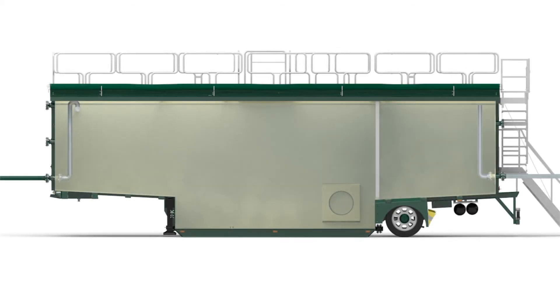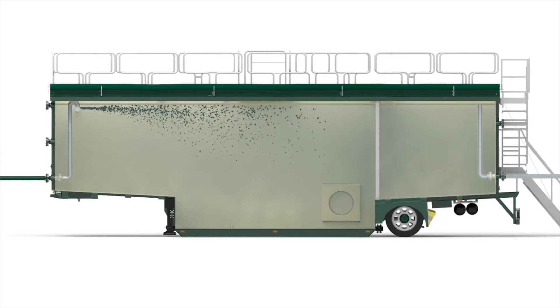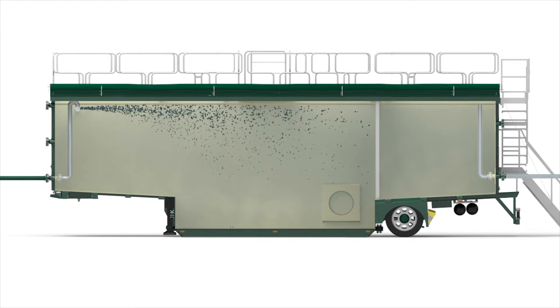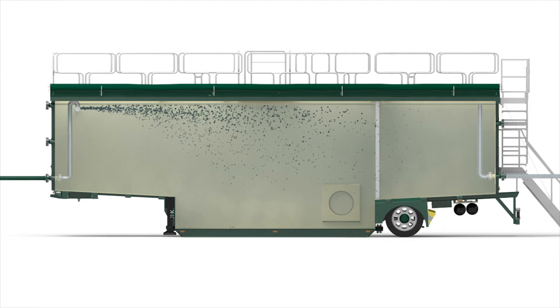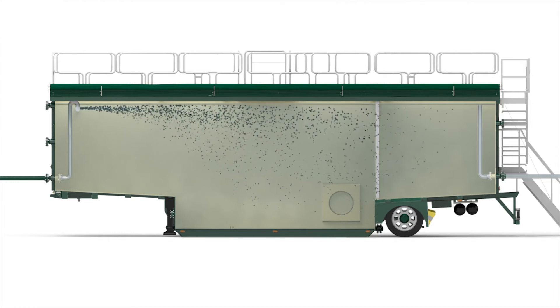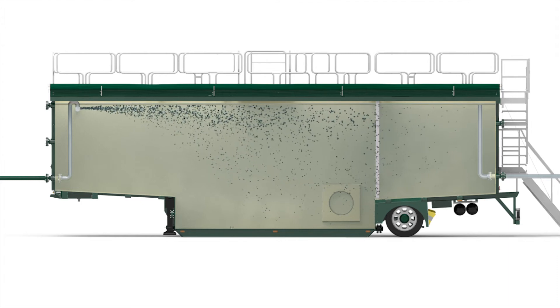The third example is pre-filtration of the waste stream from a cleaning job before it is sent to a wastewater treatment plant. Now the tank is equipped with a permeable weir functioning as basic filtration for the suspended solids. Depending on the composition of the waste, different types of permeable weirs can be selected.